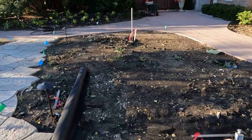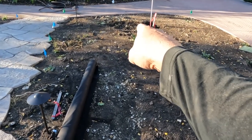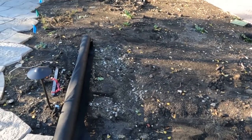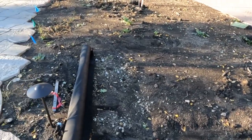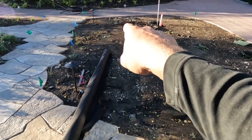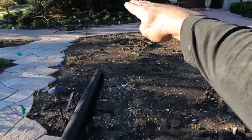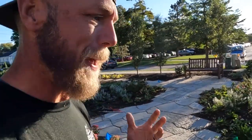Reservoir is gonna sit right around here, and then we're gonna do kind of this lazy river, babbly brook type thing. Upper pool starting over there, and then just focus way more on the movement of the stream than our normal cascades, waterfall, dramatic drops, that kind of stuff. There's no grade change in through here. We'll only be able to elevate the upper pool that starts the waterfall probably 3 to 4 inches above grade, because we don't want to have this big massive retaining wall, and that's really not what they're looking for. It's just going to be more of a babbly brook style.